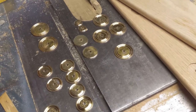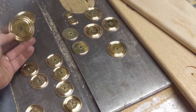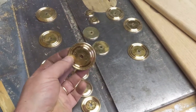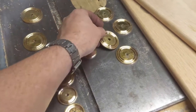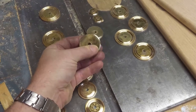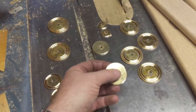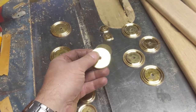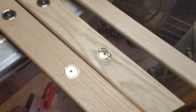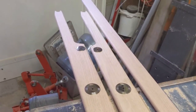Now that we have all of our various rosettes — these are for each of the rungs, these are for the brass cross pieces in the main ladder, these are for the brass pipe cross pieces in the brace, and these are all part of the hinge mechanism. This would be the wear plate that the hinge plate rides hard against. It'll have a brass shaft penetrating through so that we're not rubbing brass on wood — we'll be rubbing steel on brass for wear purposes. There are the rosettes polished up and in place for this main part of the ladder.